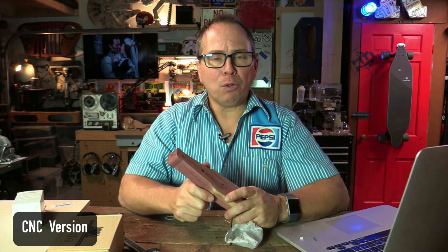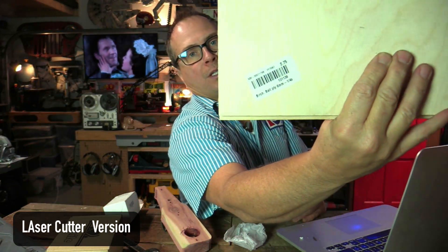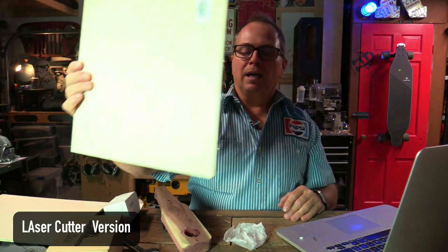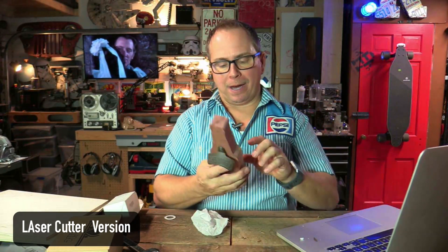For the laser cutter, glue all the pieces together, then add your magnet and your bottle opener. I used birch plywood that was on sale — two or three layers — and that worked out pretty nicely. You can use any wood for the laser cutter as long as it's less than three-eighths of an inch, and make sure you mask the front. That pretty much wraps up the mystery bottle holder — the mystery is that it's just one quarter inch shy of the top of the material, and the bottle cap drops down like that.